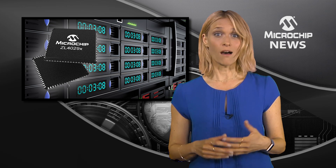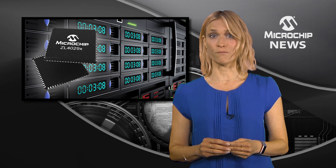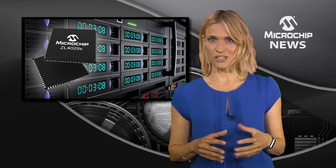And with low power, high speed, current steering logic, they consume just one third of the power of buffers using standard HCSL. They can also eliminate up to 80 termination resistors.